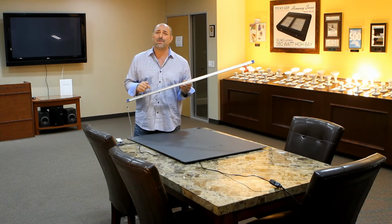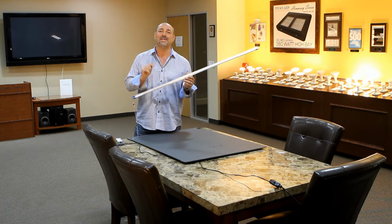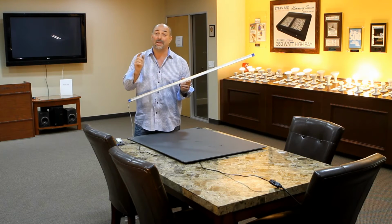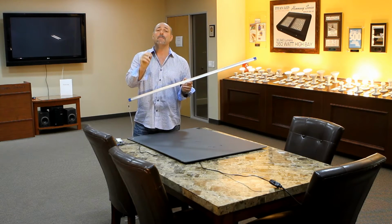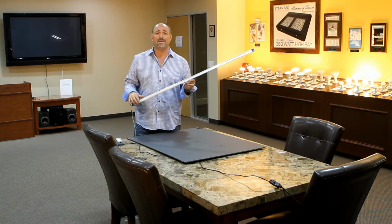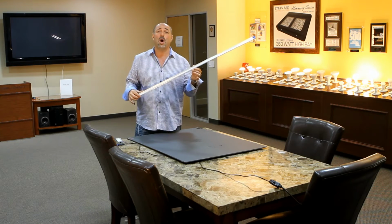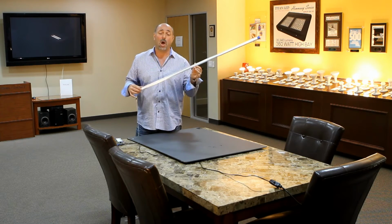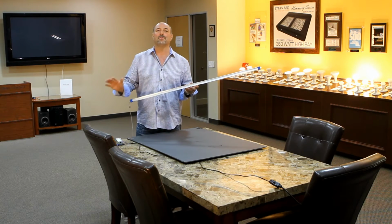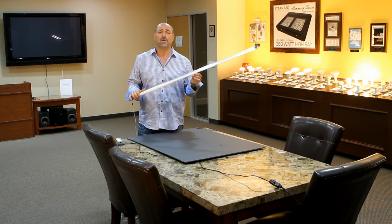This is a 3535L Lumileds chip. It's the only chip that has an LM80 data report over 100,000 hours. Spectacular, right? When I say an LM80 data report, the mid-power LM80 data report is a 3535L. What you'll find with this is it's producing right now 16 watts, 2235 lumens, doing 134 lumens per watt. It's spectacular. It's better than anything else in the space. We've also rated this tube as 102,000 hours.